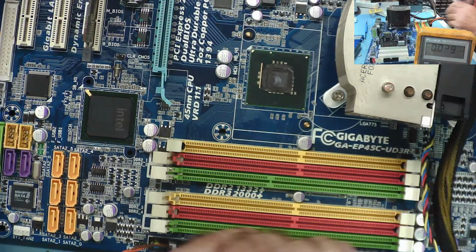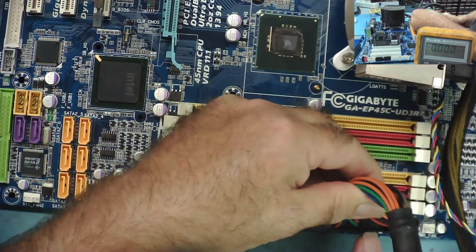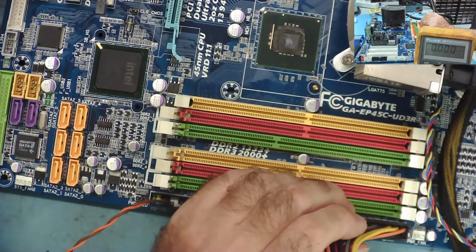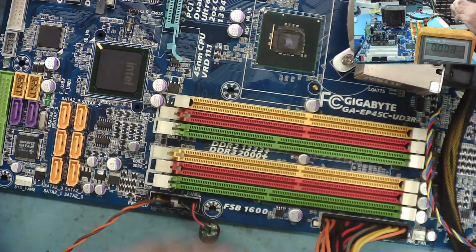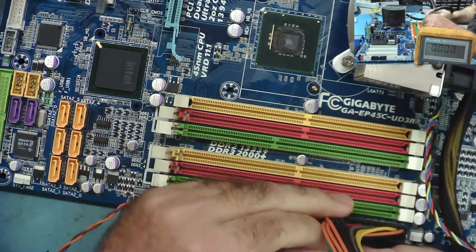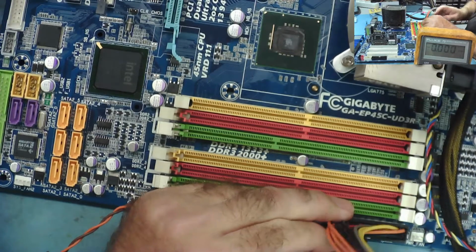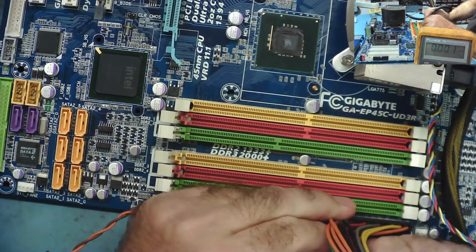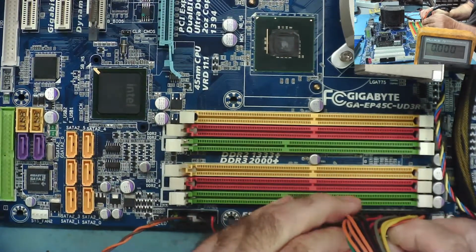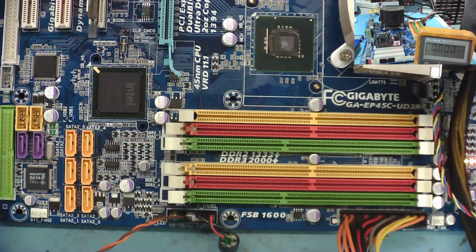So to force it to start, we just need to connect the green wire coming in on the ATX to ground. Yeah, I'll just find something. My favourite's one of these 2.2 ohm resistors because you have stiff legs on them, and we can easily poke them down the holes here. So let's just switch it off, put the resistor in here, and switch it back on. It should just start. Okay, that's grounded that. So what happens now? Yeah, started.